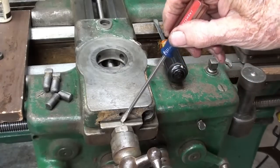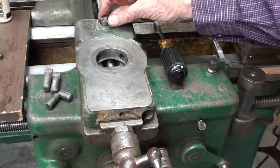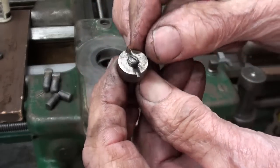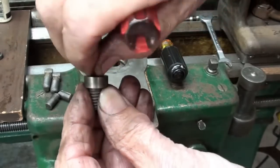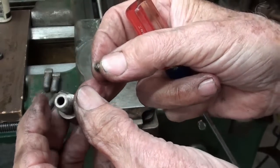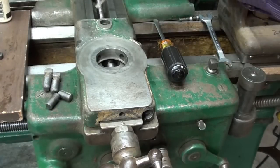There's a tiny little screw here that has to be removed in order to put a drop of oil in. Did you ever notice that the screw that attaches the brass nut has a tiny little screw in the center of it, which is also an oiling hole? It goes all the way through the bottom, and there's a hole in the bottom of the brass nut that allows the oil to get onto the screw.